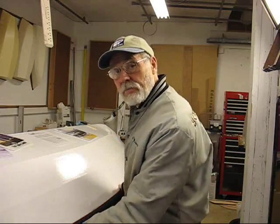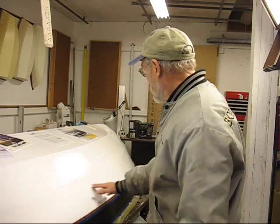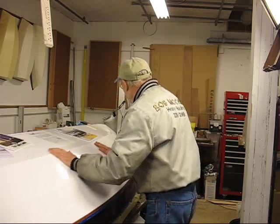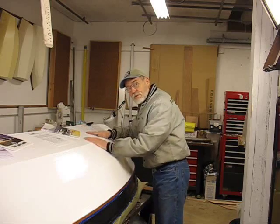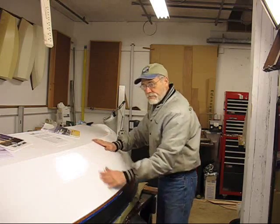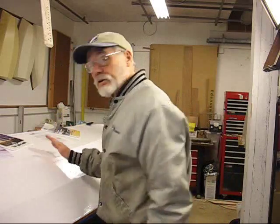I'm going to go ahead and paint this out and bring it to a conclusion with my mistakes covered. When I go over this thing and feel it — it's smooth as a baby's butt where I've put on the extra coats. One more coat now, or two years from now I sand it down and put on another can of LPU paint, and it's going to be one tough hull.